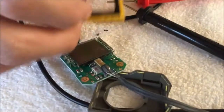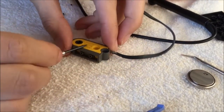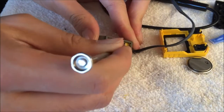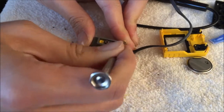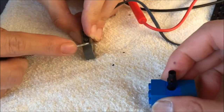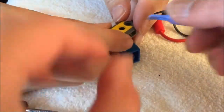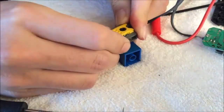Let's look at the sensor side now. This side is both more and less bad. You only need to undo snaps as with the 5306B ends, but you also need to remove some material as with the M motor clips. It's especially critical to take material off of the corner snap, as that part of the casing has very little give. Even then, we had to make a jig out of a long pin and some bricks in order to help push the yellow interior section out of the gray exterior section.